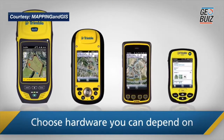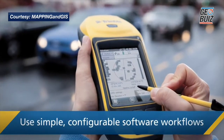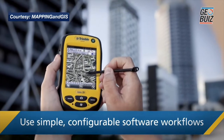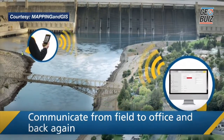On these different operating systems, you would use different types of software. In the Windows world, typically the software would talk to a virtual COM port and get NMEA sentences — that's how it would determine location. In Android and iOS, it's a little different: they both use something called location services. And obviously, we've got Trimble software that talks to the receiver directly.